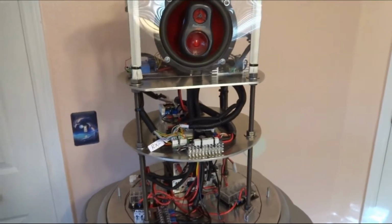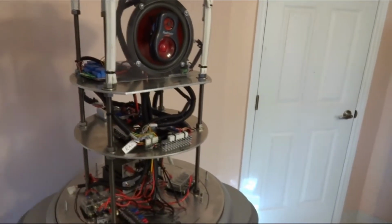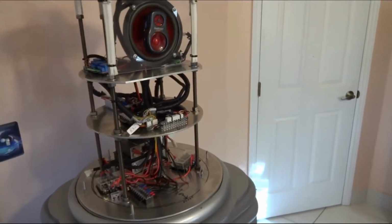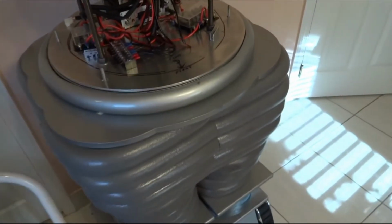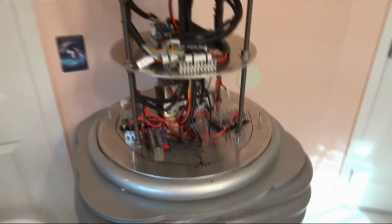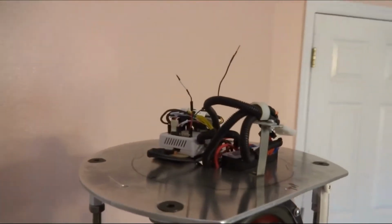I've got them all off now, but if you've seen any of my other videos on this guy, he's got two arms. There's like 2 or 3 or 4 servos in each arm, plus a big motor in the back that drives the track in and out. Plus there's waist motors down below that turn it. But if all that's running and they're running too fast, then I'll get a brownout situation and it'll disconnect from Wi-Fi and I've got a problem.